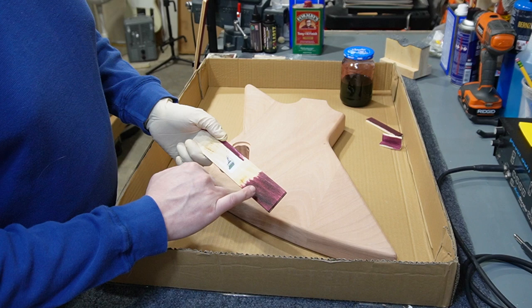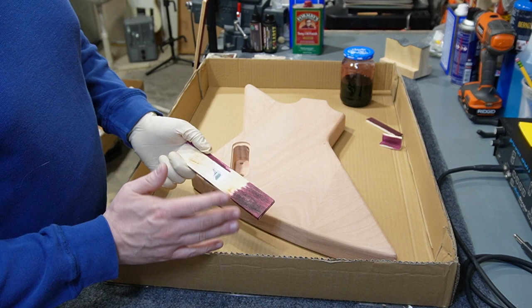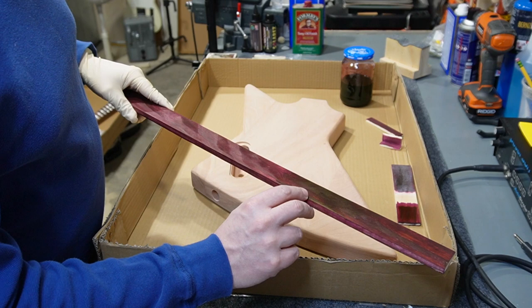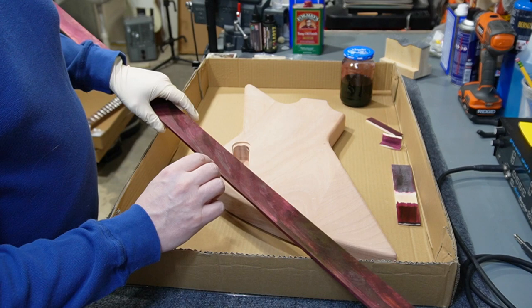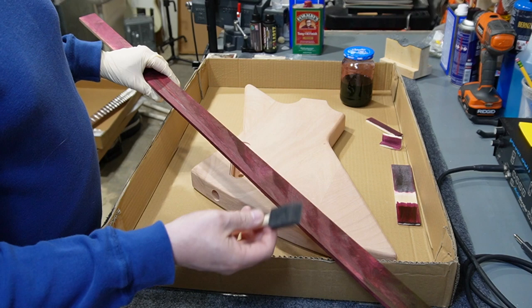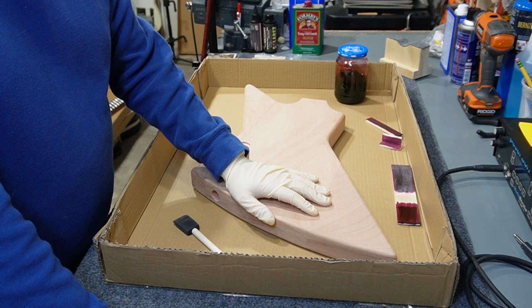I'm going to go with the diluted color I've come up with - about a 1.5 to 1, close to 2 to 1 dilution of that dye mixed with denatured alcohol. I went through a couple of different applicators and not all are created equal. I used a boar hair brush on my first attempt and there's a green hue sitting on top of the heaviest areas of grain - I do not want that green hue. But when I went back over it with a foam brush, you can get rid of that green hue, and the foam brush doesn't put that green hue on any of the other areas to begin with. So I've got to use the foam brush.